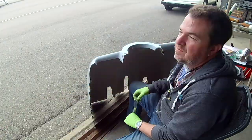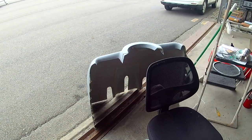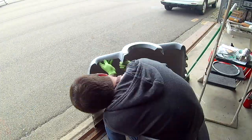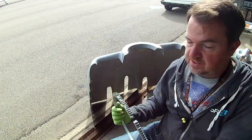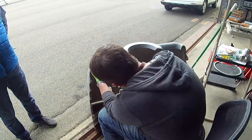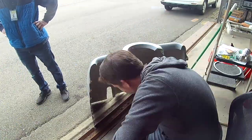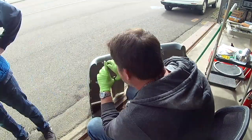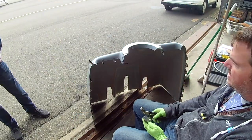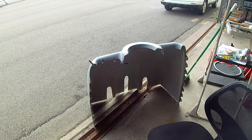That's the most succinct way I know how to say it. So what we do is we have a piece of metal that we wind up bending to form the exact measurements that we just took. Later on, that same piece of metal will be used to actually hold the baffle rubber in place. Right now we're going to clamp them in, make sure they are secure, and then add the floxed epoxy to the gaps between the metal and the cowling itself. Then it's a matter of going back later, sanding it down so that it matches and sizes correctly, then drilling holes through the whole thing, countersinking, and adding screws. That's the gist of it for the lower cowling.